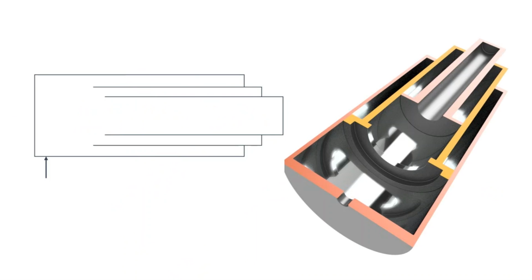Telescopic cylinders can also be made to be double-acting. In that case, they can both push and pull, but normally they are made to push only. You can see them on trailer dumpers, where they are single-acting. In this case, the weight of the empty trailer dumper will compress the cylinder as the pressure is released.